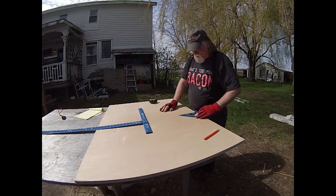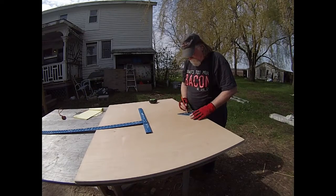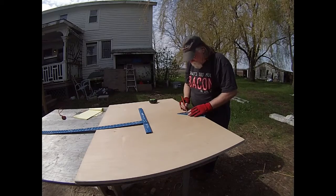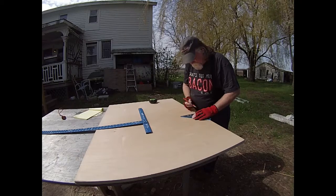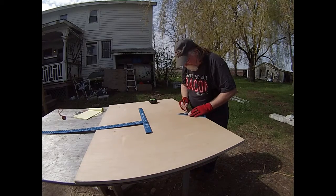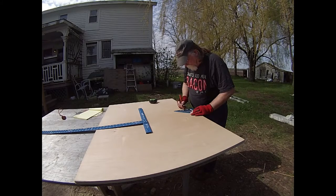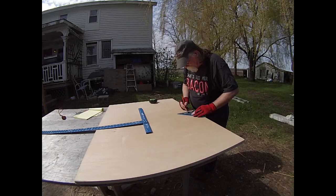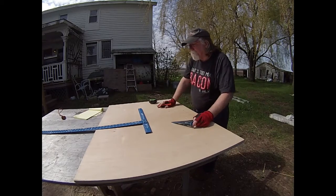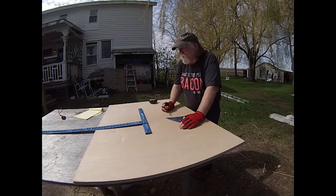But what I also need to do is a toe kick at the bottom of the cabinet, so when you stand close, your toes aren't going to hit it. I'm coming up 3 inches and going in 3 inches. And that's where this is nice, I can do that, have that all drawn out. And when I cut this, I can notch these out of here. I am going to leave a 1-inch lip on the countertop, so I got to figure that out for the cutting.